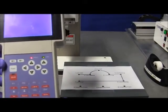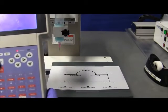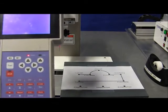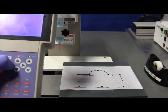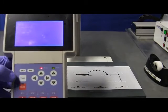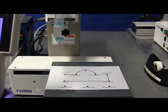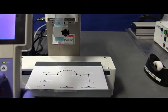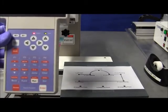If you move the X, you will see the table move as well. Those are the movement keys. Now there are three speeds: the first one is slow — press the movement key; the second is medium — press the movement key and the fast button in that order; and the third is fast — press the fast button first before the movement key. Having three speeds available is helpful in order to locate the point precisely within the pattern.